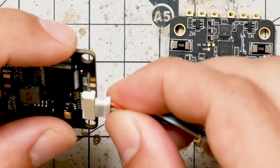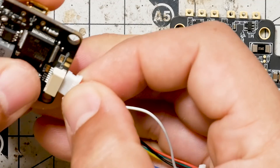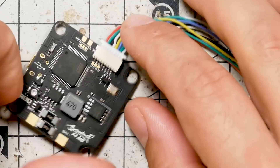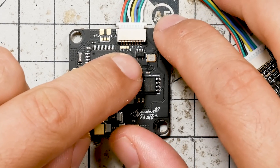The next thing you're going to ask is, how do you wire these up? For my flight controller, there is a detailed manual that I myself wrote. You can download it from the Race Day Quads product page, or pay them a couple extra bucks to print and send you a physical copy. Connecting the two together couldn't be simpler — the ESC comes with a plug and they just plug together. You'll need to use the solder bridge to select ESC telemetry, which is what this ESC outputs — not analog current sensing. Also note: this ESC doesn't have a 5-volt regulator built in. Most flight controllers nowadays can take VBAT input, so we decided it probably wasn't worth adding the extra expense and board space.